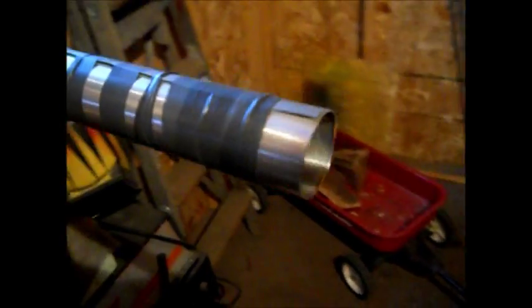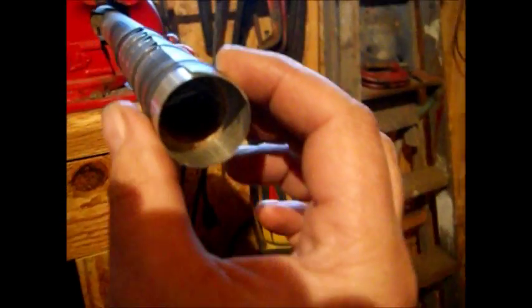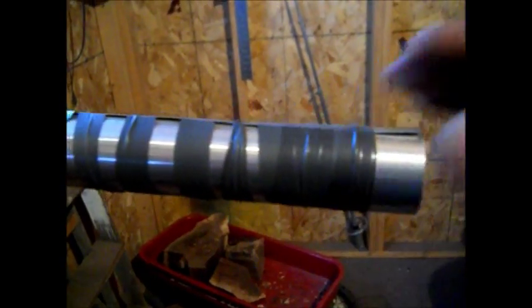I thought I'd add this in here. This aluminum flashing, this is about a 1 1/4 inch piece of pipe. I kept wrapping this around here, and I put a bunch of electrical tape. Then I'll put a rivet here. This will be the top of my little stove pipe. And I'll slowly move out. I'll slowly slide this off here, even if I have to drill through the tape.